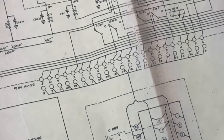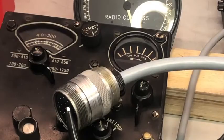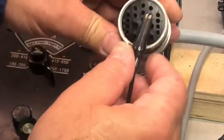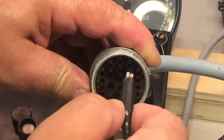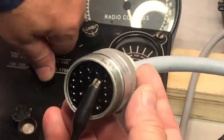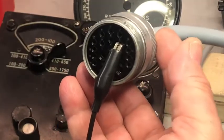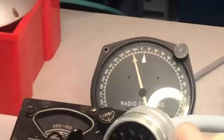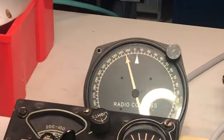Let me set up the test and see what it does. I have my S-pin here with the ohmmeter, and if I switch to position one the ohmmeter should sound — and it does. We clearly have continuity, so there is no connection problem and the problem must lie in the receiver.